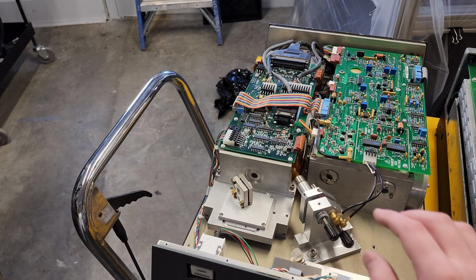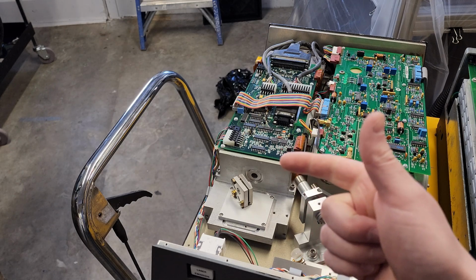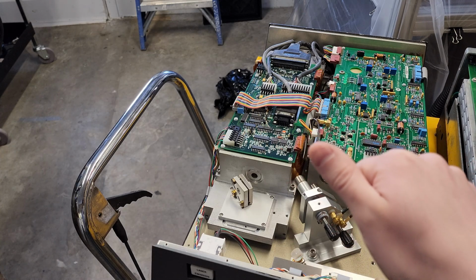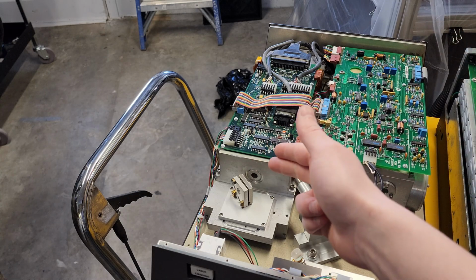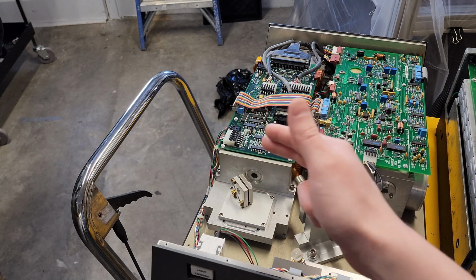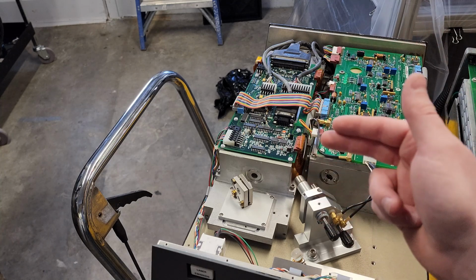But in principle, there's a laser diode. Check if that's working or not. Confirm all the electronics are working correctly. Checking that laser diode requires me to look at the spectrum and its output power. If that passes and electronics pass, then we come to this box here. If this box passes, it's producing green light, that's great. If this mirror is not performing correctly, we don't get any green light out of it, well then, there's the mirror. But if the mirror passes, that's good.